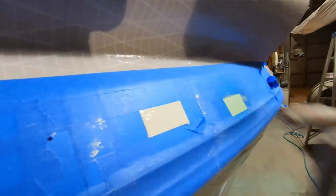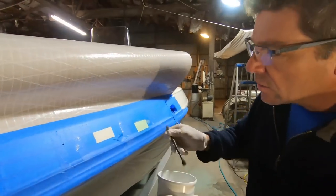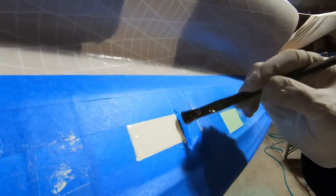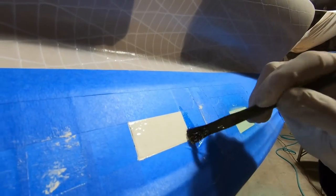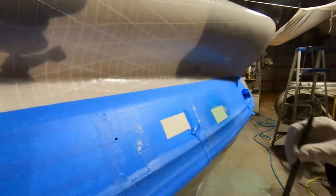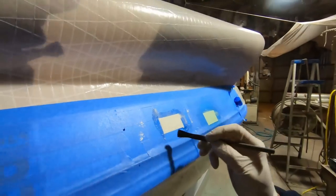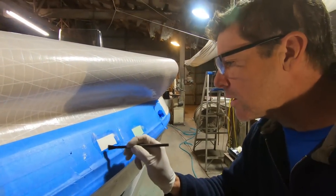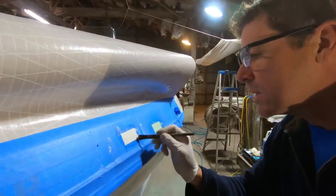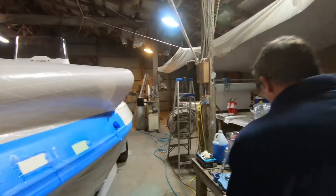You can see there's a little bit of an edge where it stands proud. If you want to make your sanding easier the next day, I put a little bit of styrene monomer on a brush and you can soften that hard edge. Of course you can use a gun and spray gel coat, but the tricky part with spraying is you normally have to thin it, and thinning can change the color. I'm cleaning up some of the edges.